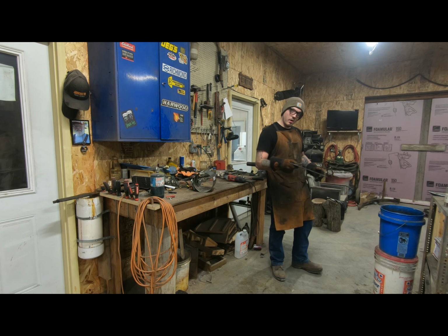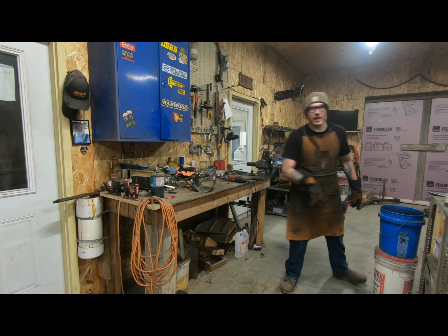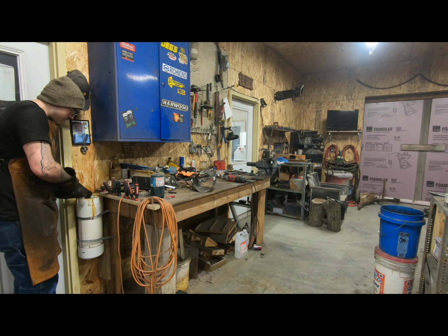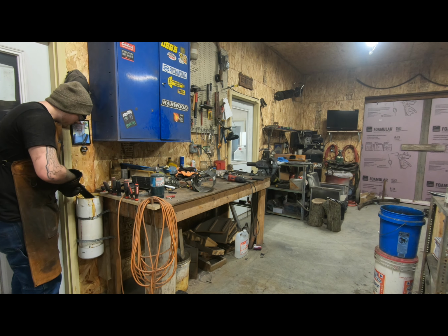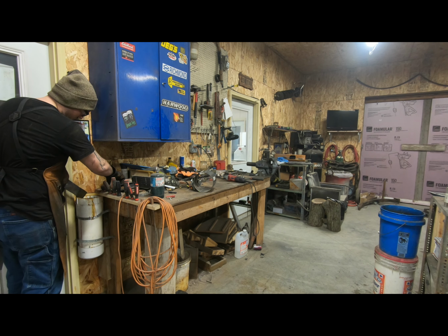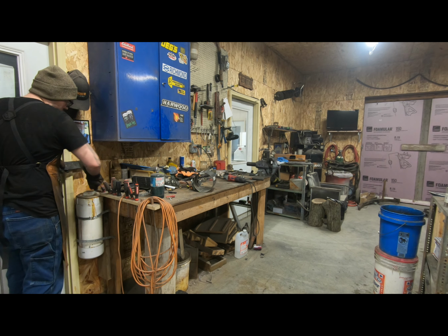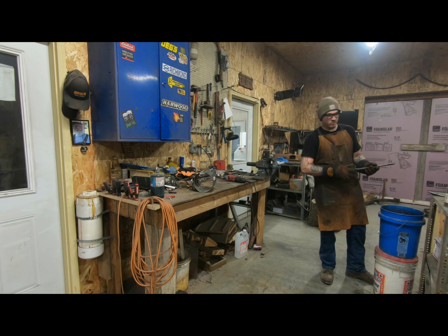I'm going to stick this into the water so that it can neutralize some of the acid while I'm doing stuff. Mix things up a little. Dilute that acid just a little more. I'll stick this one back in here, move it around a little bit. Maybe get some more etch into this one, make it a little darker, more contrast. All right. Cover on it because we really don't want someone in the shop to get into that. All right. Haven't seen it yet at all. I'm going to neutralize some of the acid and show you guys billet number 2.